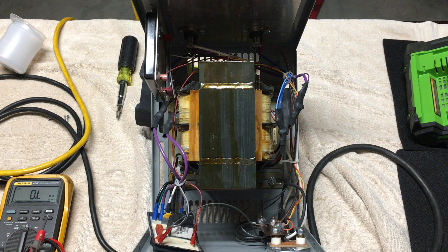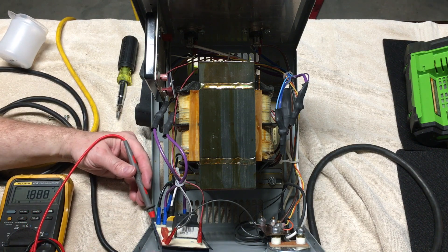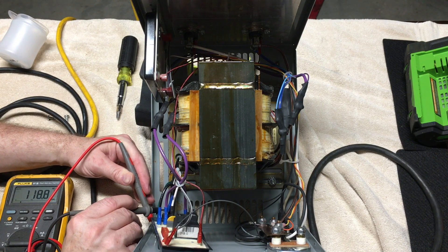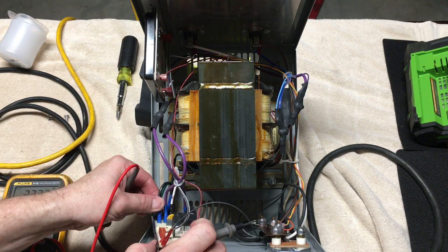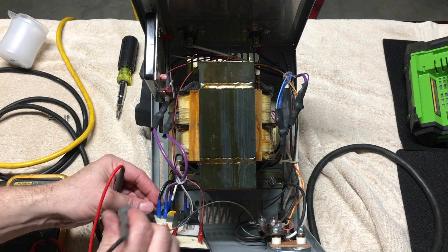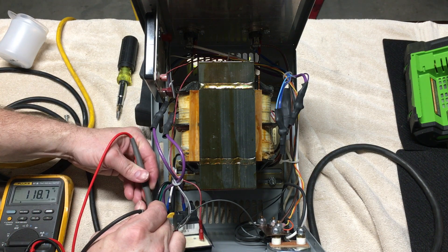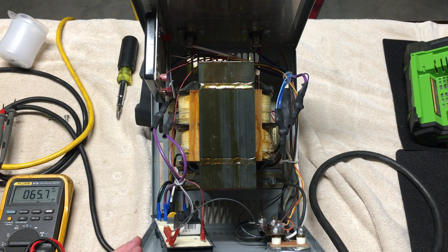Now I'm hooking the charger up to AC power. You have to be very careful with mains voltage. Going to ground or neutral I'm getting 119 volts on the black wire to the circuit breaker, and the same on the other side of the circuit breaker — so power is getting all the way to the board. I backed the terminal off just enough to probe it, since it is an insulated terminal, which is a good thing, and I'm getting 119 volts there.